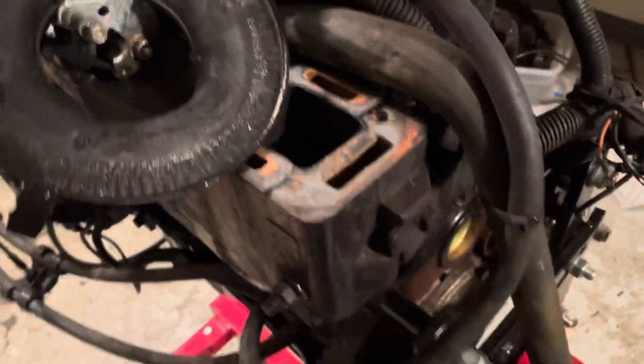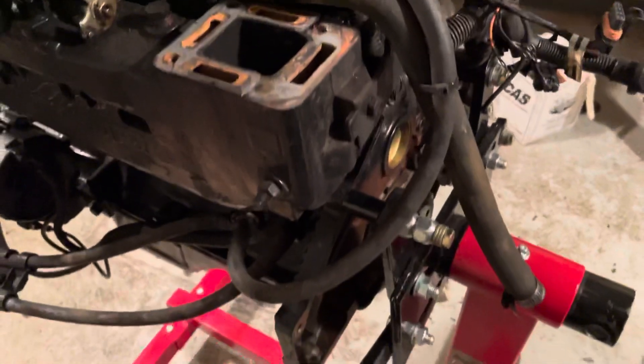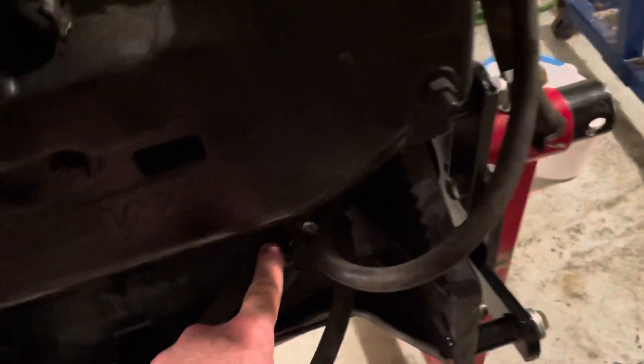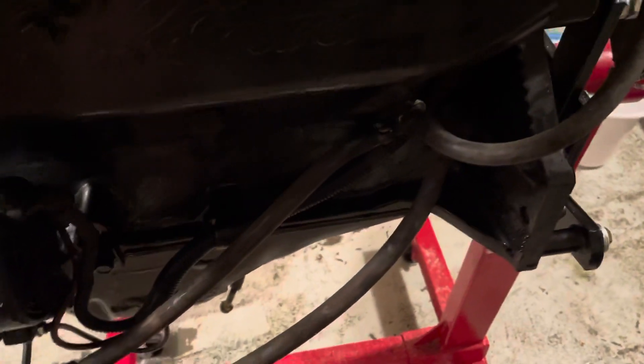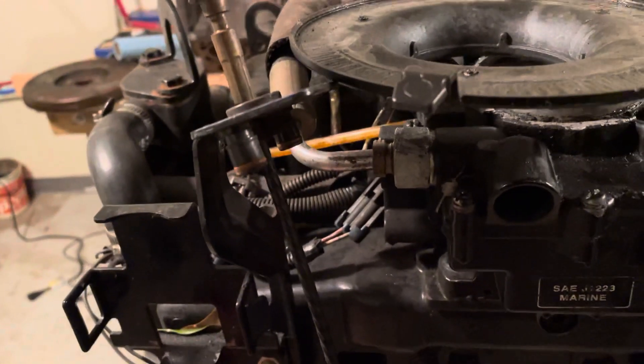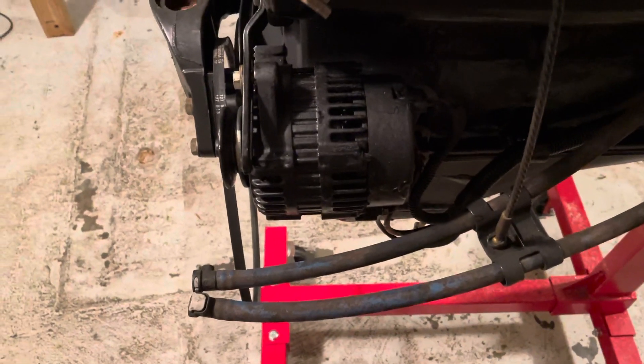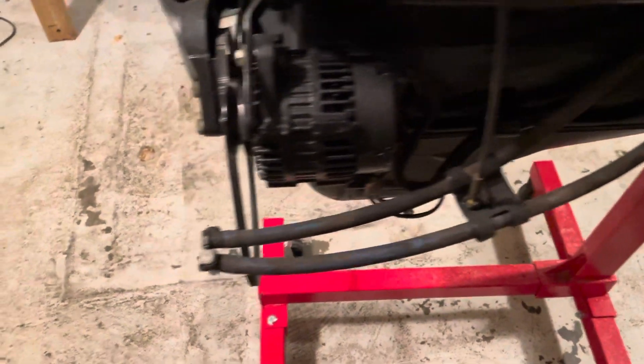I had to pull the riser off to get it to clear out of the boat. This engine has an automatic drain system with two lines. This line here goes up and comes out of the block to drain the block — there's no valve, it's open to the hose, and that hose stays full of water all the time. The other hose drains your exhaust manifold coming off right down here. These hoses come up and attach right there and right there — you can see the rubber seal, so when they're attached they seal the water. When you want to drain and winterize the engine, you just push these buttons in, it frees the connection, drop the two hoses, and it drains your engine into the bilge of the boat. That's an interesting way of draining these four-cylinder boats.